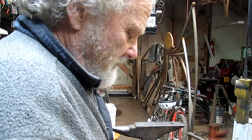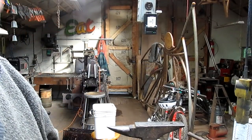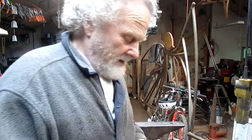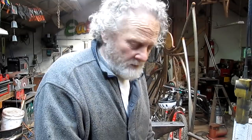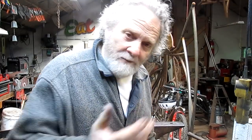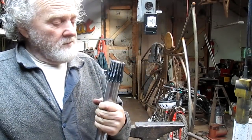And I told them, well, we can make new ones, or we can just go in and repair what we've got. And these things travel pretty slow. It's a roller, so I'm guessing 1 RPM, 2 RPMs maybe. So it isn't like we've got a high speed hole that we've got to deal with. All we're really dealing with is a mesh of teeth. So we just clean up these teeth and of course weld and repair that.